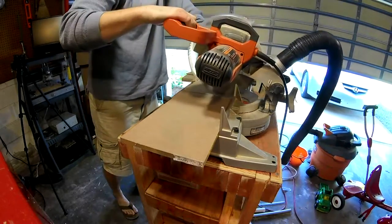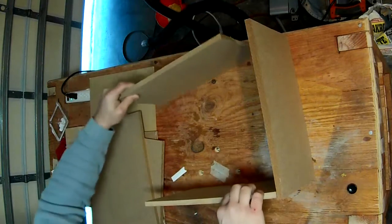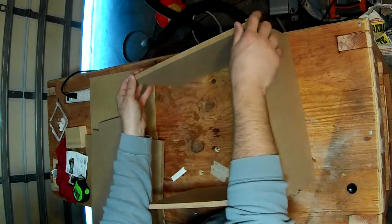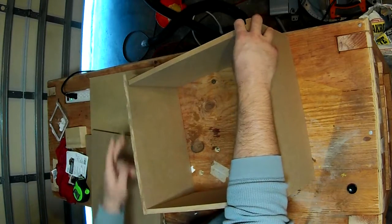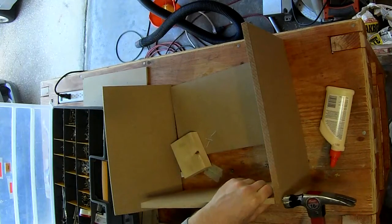In order to get this layer of protection, I built one out of half-inch MDF and some laser shielding from J Photonics. This shielding has a 4-plus OD optical density for filtering the laser and up to a 500 nanometer range, which is important because not all laser glasses are created the same.